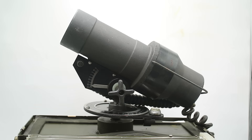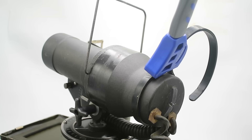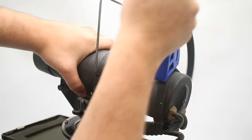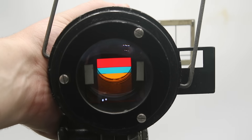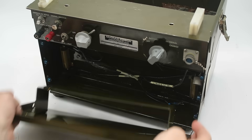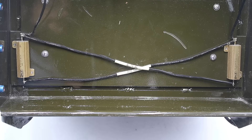Let's disassemble the projector itself — this is actually surprisingly tricky. First, we unlock this wire latch by pulling it back and flipping it out of its slot on the back, then pull or twist off the rear of the housing. Strangely, this isn't threaded — it's just held on by friction with an o-ring and is a very tight fit, so I'll use a strap wrench to remove it. In the back we have the light bulb with a parabolic reflector to collimate its light into a linear beam, and in the front we have the tricolor filter and some additional lenses. To access the internal circuitry, we undo the screws around the edges of the two front panels. The bottom panel holds the bracket for the battery — unfortunately missing in this example — while the top panel holds all the controls. Inside the compartment we can see a voltage regulator and two large resistors, which are part of the battery charging system, as shown on a handy little schematic on the inside of the top panel.